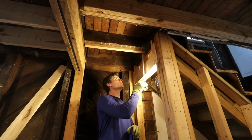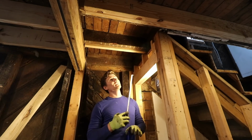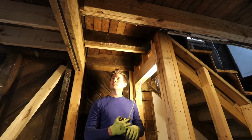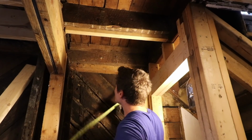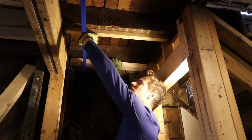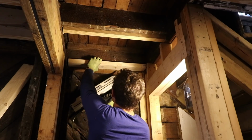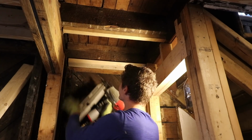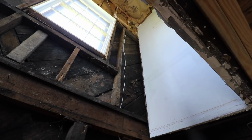I'm going to put 1.5 inches here, and then I'm just going to run a little small strip of something just tacked up here just to shim down the drywall. And like I said, renovations, it's all a rig job. Rig job does not always mean something bad, though. It just means you got to get in there and rig it up to make it work sometimes. Otherwise, you're rebuilding. Moving on, one of the next things I need to do is put a 2x4 right in there for nailing for drywall.